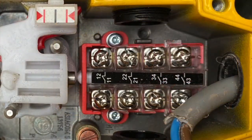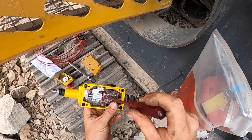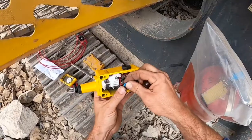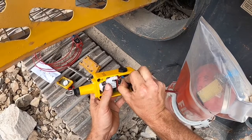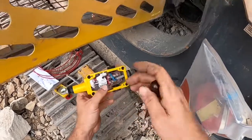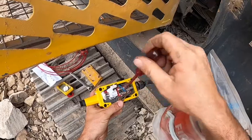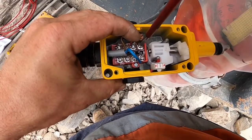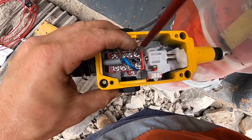This means when the e-stop is activated it will break the e-stop circuit, which will shut down the machine. The other connectors — 34 and 33, 44 and 43 — are normally open, meaning when the e-stop is activated it will connect the e-stop circuit, which in some setups will shut down the machine or belt. A lot of machines use a closed e-stop circuit because in the event that the wire harness is broken or cut, the machine will shut down and you won't be able to start it until you fix the harness. This stops you running the machine with a disabled e-stop system.